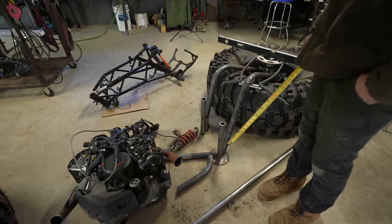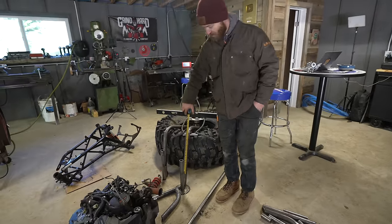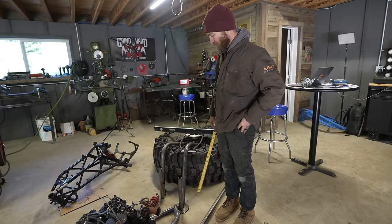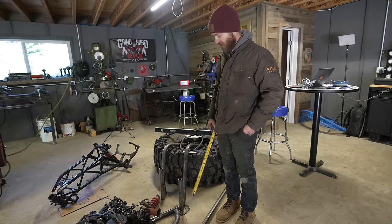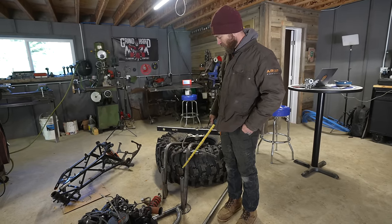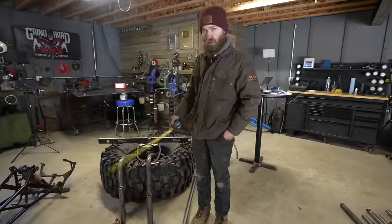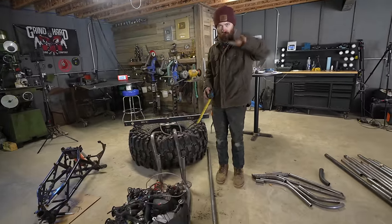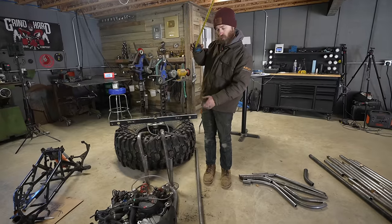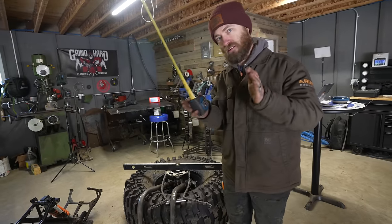And I've thought about, there's two ways to do it basically. One is I have the jack shaft be concentric to the suspension pivot, so they both pivot around the same shaft. But I've decided that that's actually more complicated than having separate pivots because if the pivots for the swing arm are separate, they can just be like a plastic bushing type pivot because they don't need high RPM. They just go. And also just trying to fit all of that stuff onto one shaft with a bunch of different bearings and carriers, it just gets very complicated to make the jack shaft.